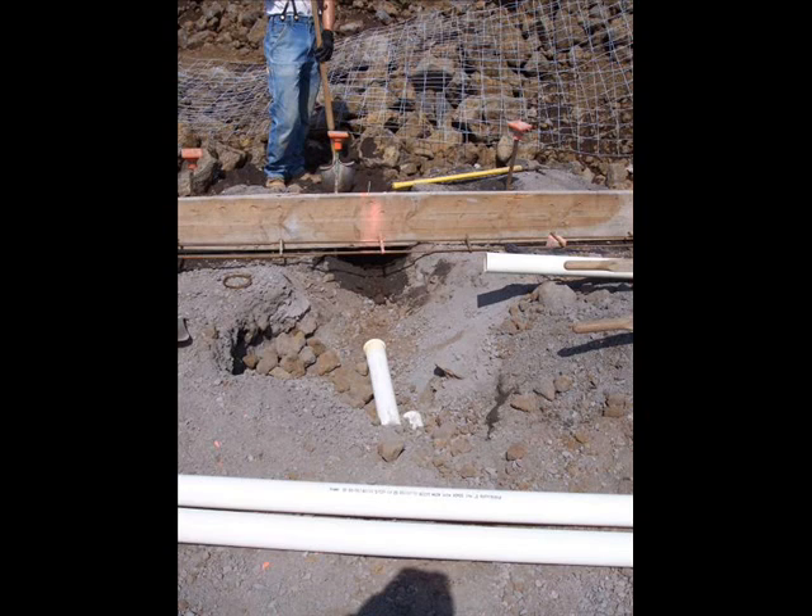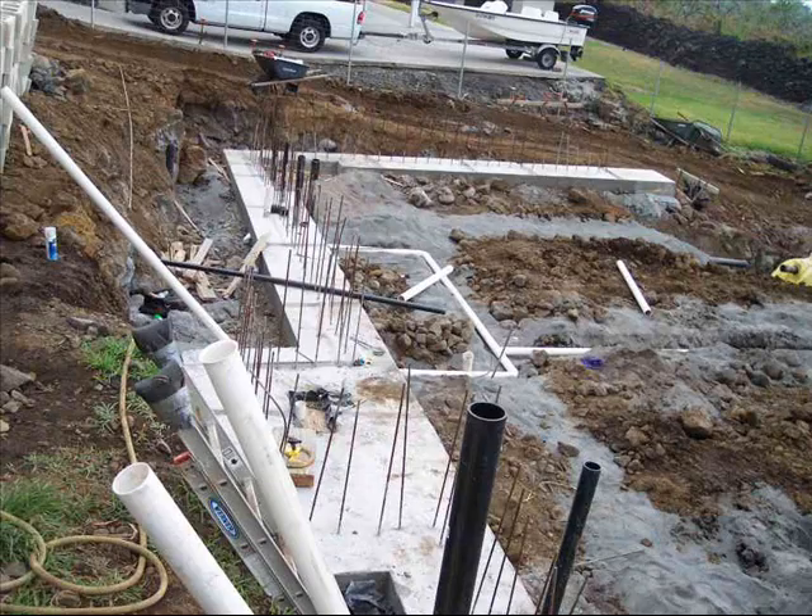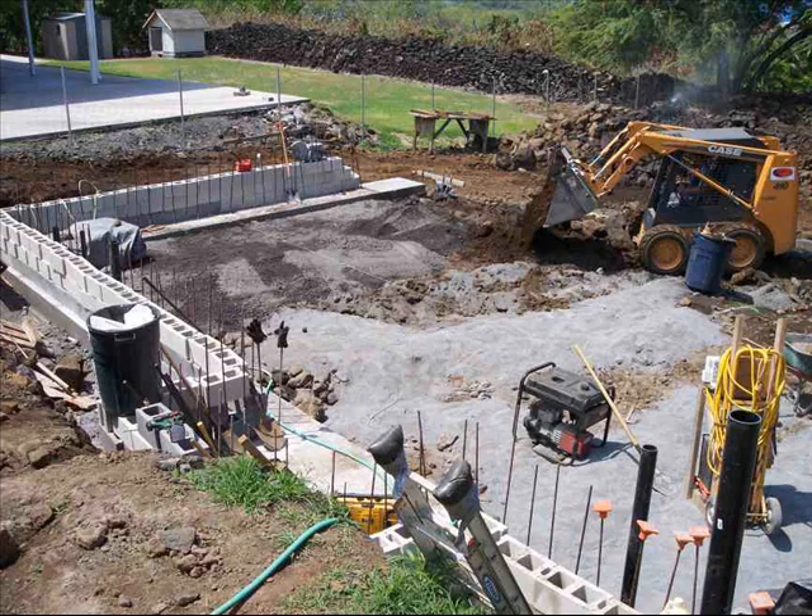As you can see, as we poured the cement, we installed the pipes — in this case, 3-inch PVC. The finished product is just a pipe coming out of the slab, which will be enclosed in our walls and will go up to the vent on the second floor.